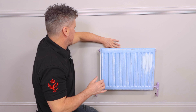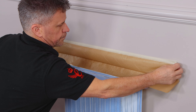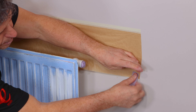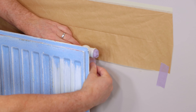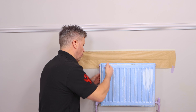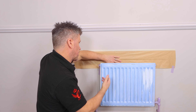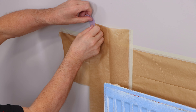The next stage is I want to protect the wall around the back of the radiator. So I'm going to be using a masking tape with some paper attached to it. Once your cover tape has been rolled out and applied to the wall, you can then tape the corners down to stop it moving or touching the radiator. Some radiators are different sizes and shapes and the tops and depth of them will also differ. So whether you're painting with a paintbrush or a roller, trying to get those bits at the top where you can't generally see unless you're looking directly above — it's just a way to avoid any splashes going onto the back. The paintwork behind is covered up and I'll do the same again both sides and below.